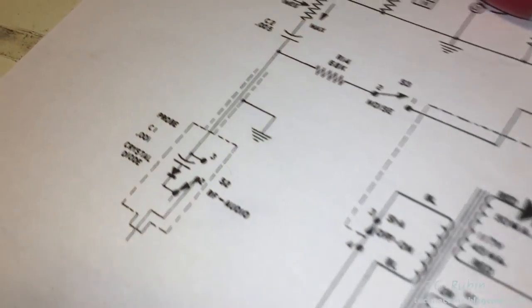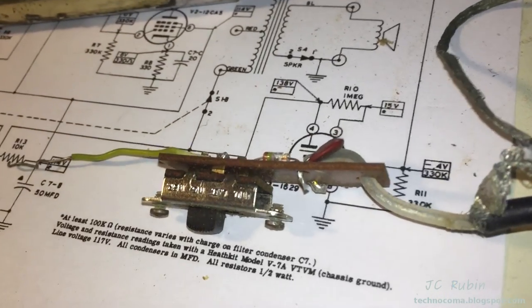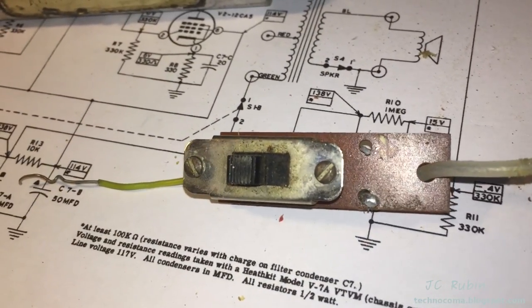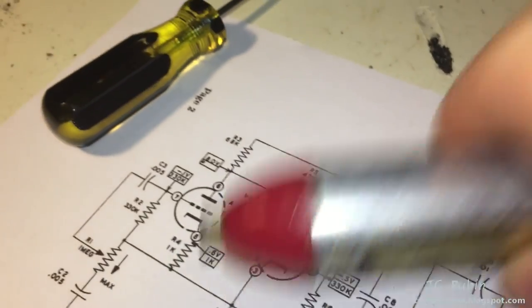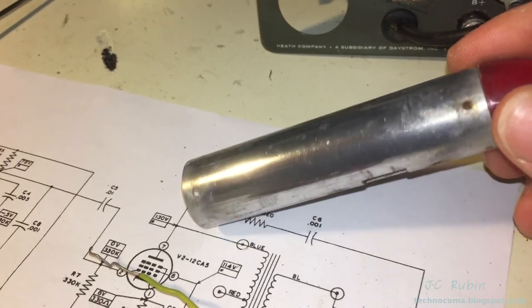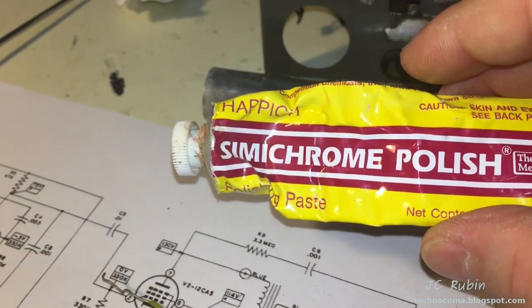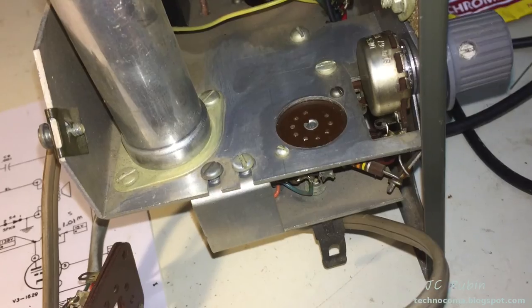It should come as no surprise looking at the schematic that there is some circuitry within the probe — a diode, a capacitor, and a switch that changes the flow of the circuitry — and the shell which I've removed to expose this and the ground. This is going to need to be cleaned up and checked to make sure these components are working. A suitable replacement part for the tip can be found easily — there's just a tip missing, a screw, and a label. A little chrome paste will polish the aluminum right up. I used Simchrome that I use on the motorcycle — 40 years of crap pulled out of the aluminum in just one minute.